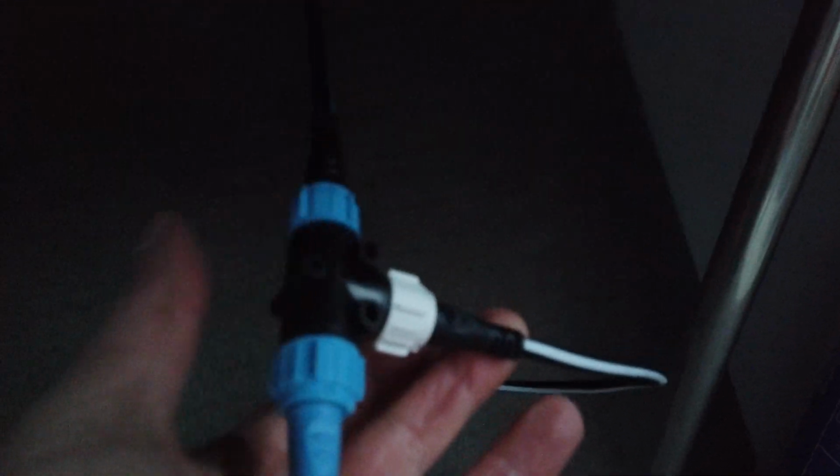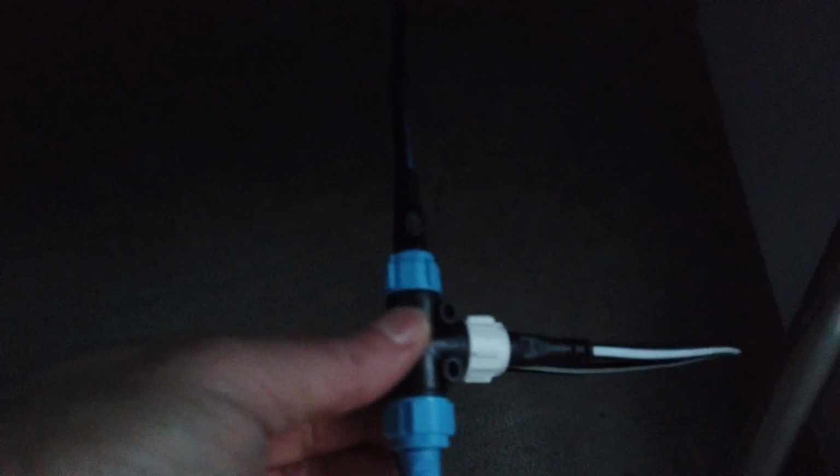So we've now got the T-piece connected with the backbone cable and the data cable coming from the ActiSense, and this T-piece is terminated there. And here we've got the ActiSense, and because we're all powered up on the network, that is flashing. So that's indicating that we're working at this stage anyway. Next is to test it all.